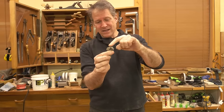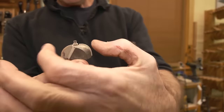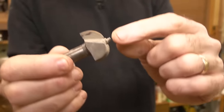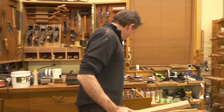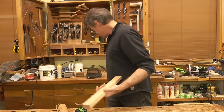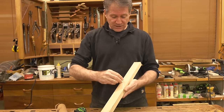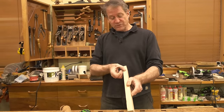It's basically just a smooth arc — there's no pin. So the one I have in the router is seven-eighths in diameter, just like a nose arc. This is a half-inch cove cutter without the bearing on there, that's why it looks like this. So we're just going to cut the groove with that. I want to have my flattest surface down for the sanding, so this will be my face. I'll put that against the fence and we'll run our thumb groove down each side.